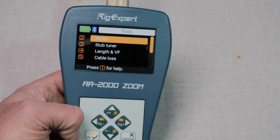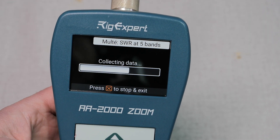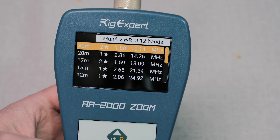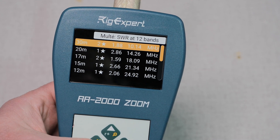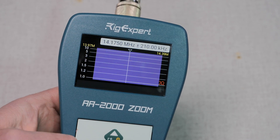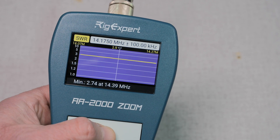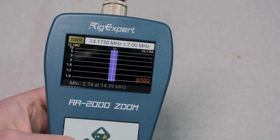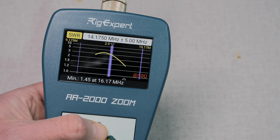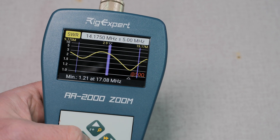The second multi-band option is the multi-feature. This will scan all of the amateur bands and tell you which ones the antenna is good for. This is handy for checking a mystery antenna or just seeing at which other points an antenna is resonant. I'm a really big fan of the multi-feature — my Stick 230 has it, and it's usually the first button I will press when I check an antenna before plugging it into my transceiver. One nice feature of the AA2000 is that I can scroll and select a band for a deeper look into the antenna's performance on that particular band.